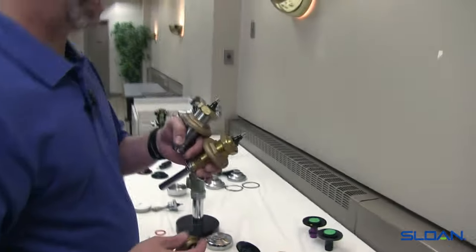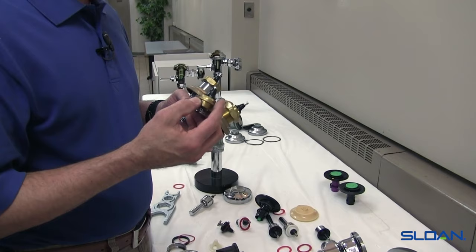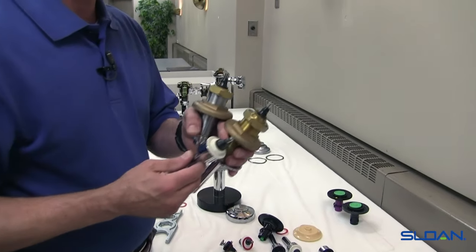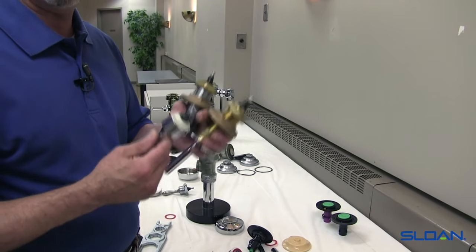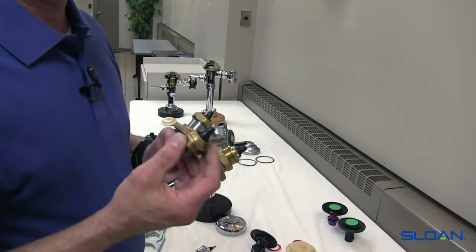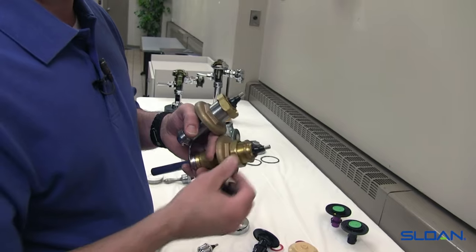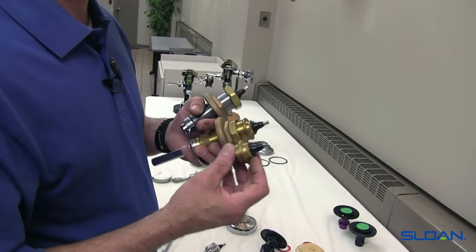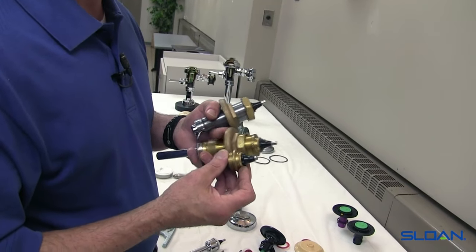So we replace it with the concealed repair kit — the C77A. We also offer the C70A, which has the standard seal found on the B32A so it won't last as long. But when you put it together, you can apply a little 100% silicone grease on the inside to extend its life. Or you can get the C77A, which comes pre-assembled and pre-greased with the higher-quality cone seal. We prefer the C77A — it'll get you further life expectancy out of the handle assembly. On this valve body we use the C70A or C77A — not the plastic one.